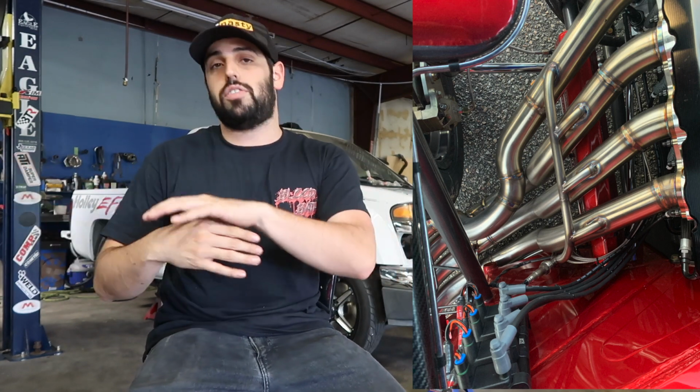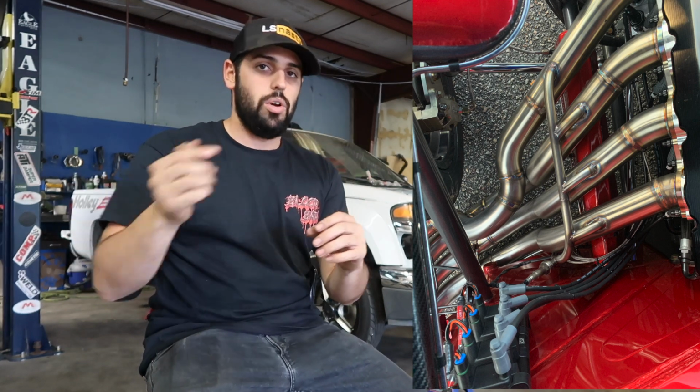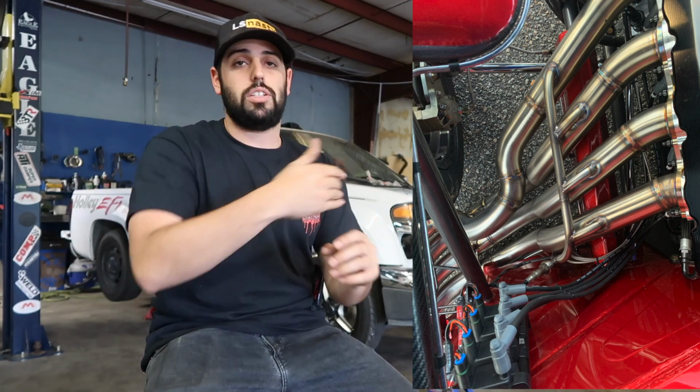Then I also hit this other road bump of how I'm going to read an O2 on the zoomies. So I'll put a picture up on the screen here. When we were down in Darlington, obviously a lot of the Pro Charger cars have zoomies on them. Kevin Rivenbark's car, Jason Harris's car. We saw this CTSV down there that had the front end off and you could see how they were doing the pickup. You have to get a collection of exhaust gases from every single primary on that bank. You can't just have an O2 in one because it's going to give you a false reading. So they are tapping into all four, then they have the O2 bung there, and then they're tapping back into it. So it's pulling a vacuum effect of exhaust gases from each cylinder and then running it across and down. So that's what we're going to do.